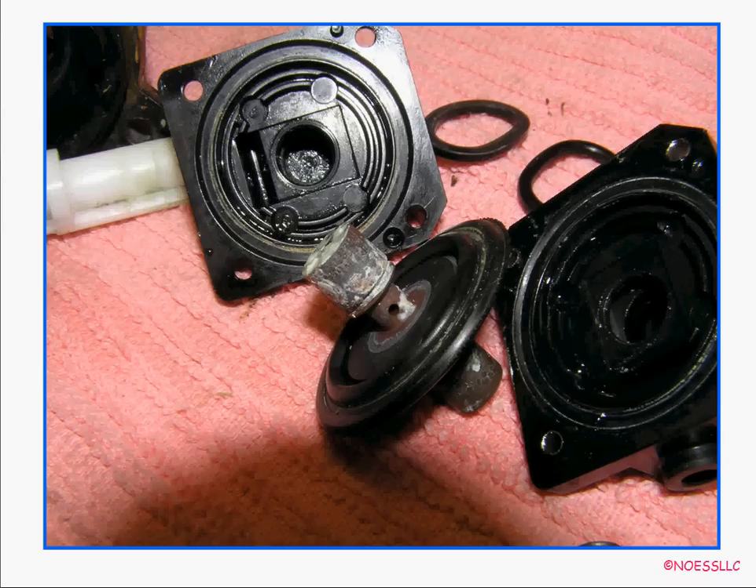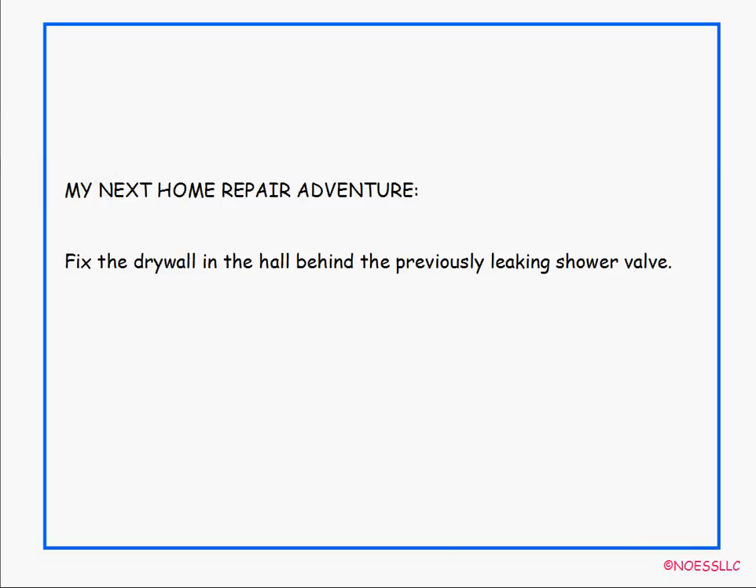There you go — my Price Pfister shower. The next thing I've got to do is go fix the drywall. I'm going to have to cut some of the baseboard away and the drywall away and probably find some gunky mold stuff behind the wall, but I haven't gotten to that point yet. Just fixing the leak was kind of entertaining. It took me a couple of days between figuring it out and ordering the parts. I hope that helps you if you have one of these apparently unusual Price Pfister valves — they use a compression method that's a bit different from the standard kind where you pull the whole unit out at once. 10-4, Roger Rubber Ducky, over and out.